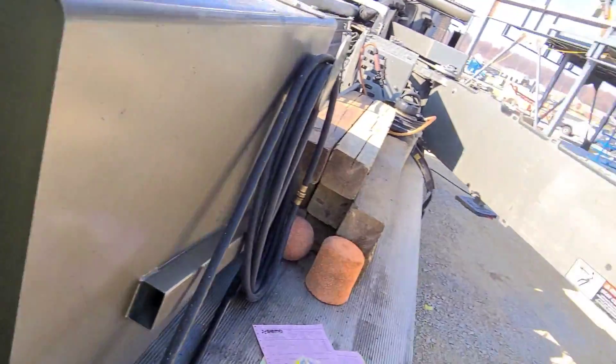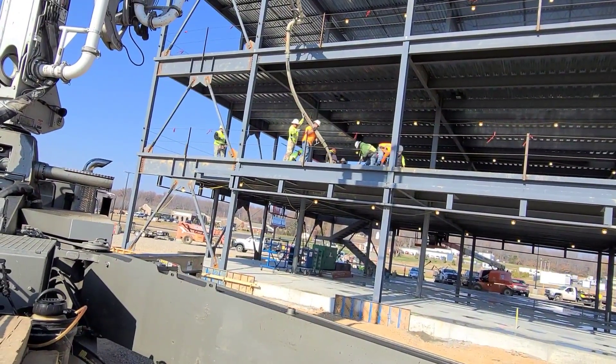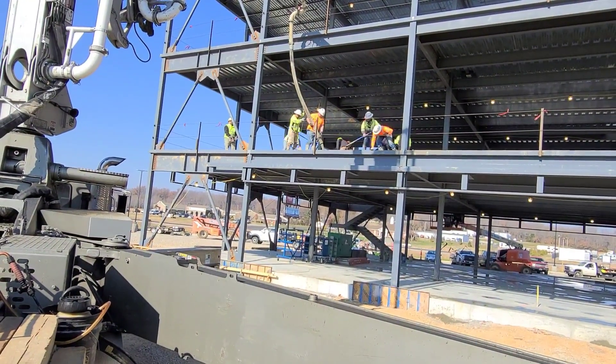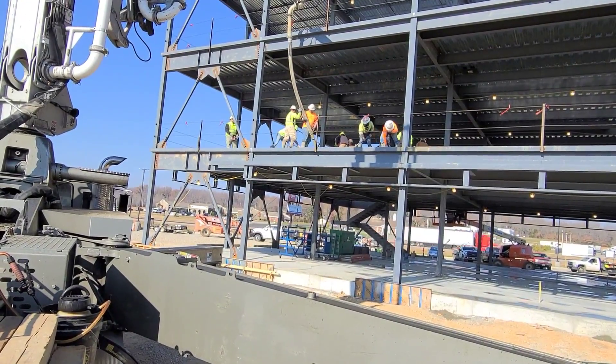Let's go back up on top, see what they're doing up there. 32 meter boom, 16-cell pump kit on this cat. Pumping good now, but we put three bags of primer in that truck — that's also a pumping aid.